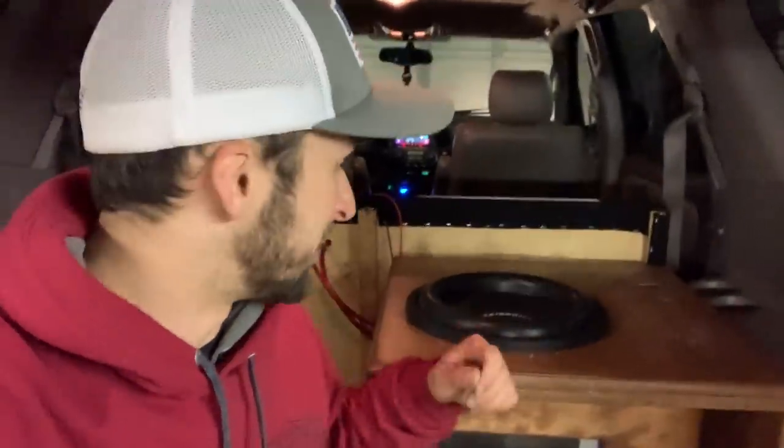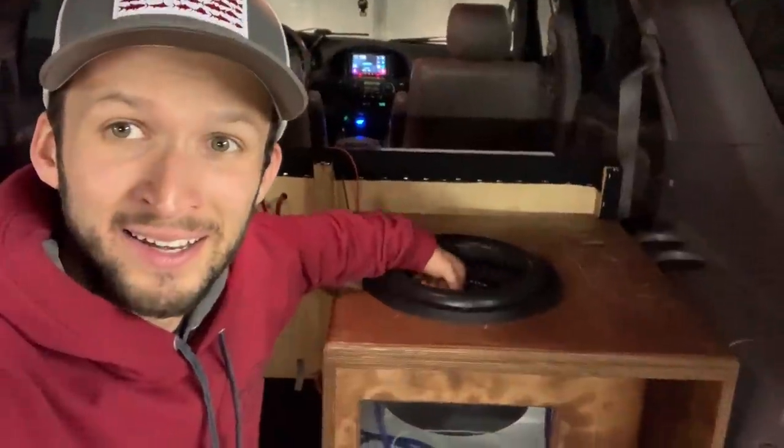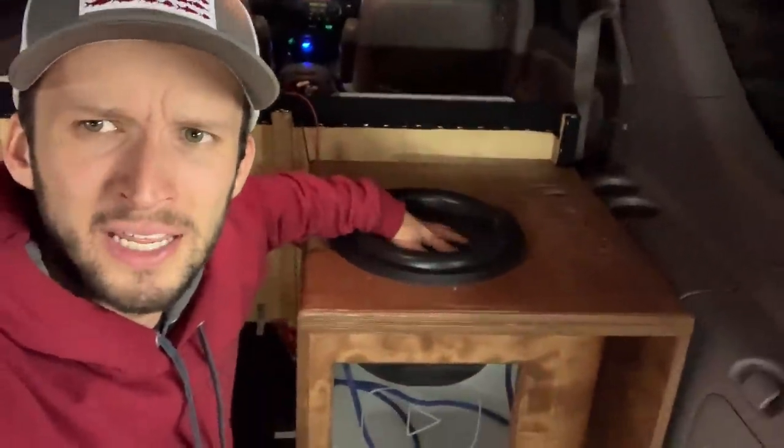Always a relief when I make it through one of those tests, guys. You just never know. I have had subs blow up while doing that. So, again, nice. Don't feel any heat up here on the dust cap. I do smell it a little bit, though, when I get in here. So, that is what it is. We were pushing it pretty much staying between 1,000 to 2,500 watts there. And it made it through without any damage, it looks like.